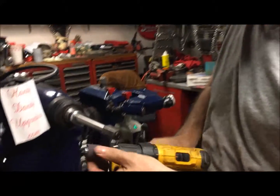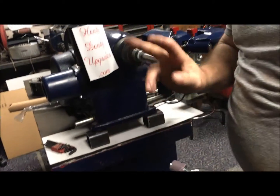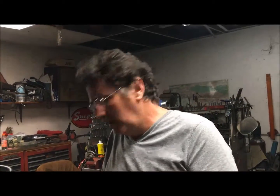one of these sandpaper disc things, drum things, and go in there and you're just gonna deburr, just take off the burrs so that it slides through. The guide bar holes were drilled correctly through the housing. They were just never cleaned up for it to slide. So you just go in there and quickly deburr it on each side and make sure it slides through there.